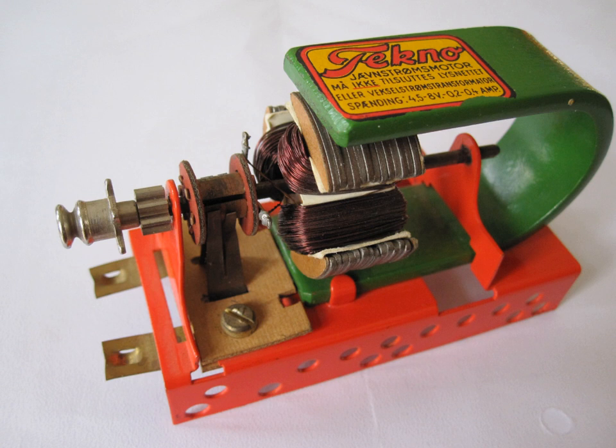These fields were usually horseshoe shaped, with either permanent horseshoe magnets or else either one or two field coils at some distance from the poles. Early insulated wire was insulated, if at all, with wrappings of cotton thread. These coils could only handle a low temperature rise before overheating and burning out with a short circuit.